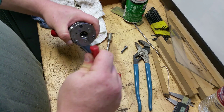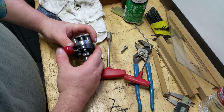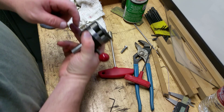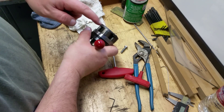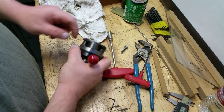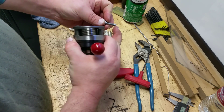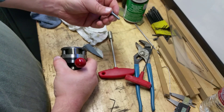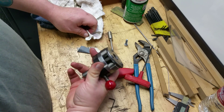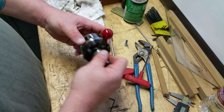It's not exactly a cutaway view of how it works, but it should give you some idea. The theory of operation is you've got roughly a four-degree taper this way and maybe four degrees that way, and that causes these concentric rolls to actually create the angle on the thread. The magic of exactly how that works I'm sure I could figure out, but somebody figured it out a long time ago. Thanks for watching, bye.